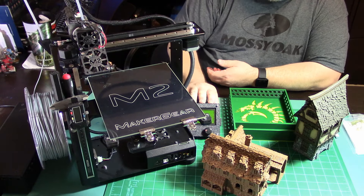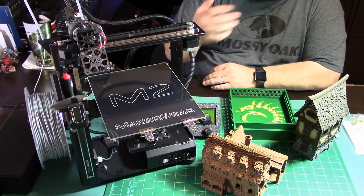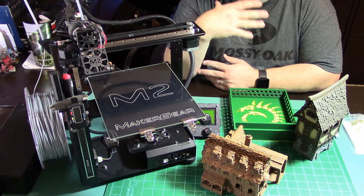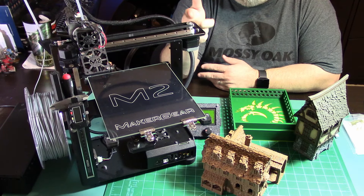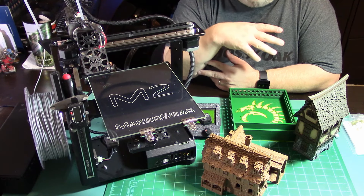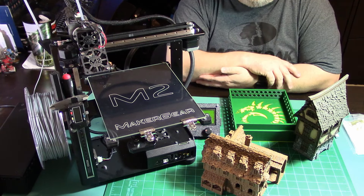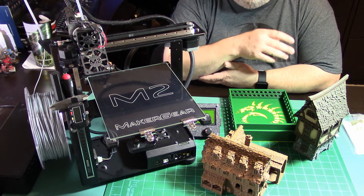I think it's a good add-on if you're not looking at doing some other type of interface device. I did start printing with it connected directly to my computer - I know you're not supposed to do that, but it just worked. I like the control that Simplify 3D gives me when it is directly connected to the printer. Being able to monitor stuff, see the temp graphs, see the G-code going along, and get a visual representation is nice.